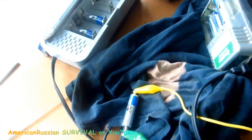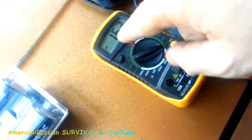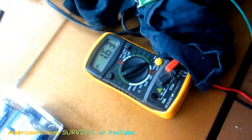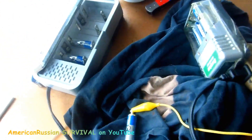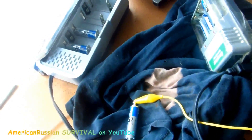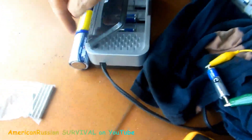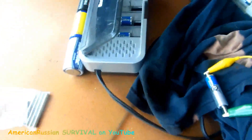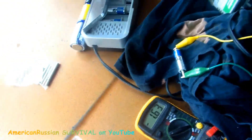What you need to do while charging is check your voltage, charge for a while, then let it sit and cool down for about half an hour, then charge again. More than likely you're going to bring that battery back — not 100%, but probably 80 to 90% of what a brand-new one was. The key is not damaging it with too much heat or too fast a charge. They're not designed to be recharged, but I've been very successful with Rayovacs. This is for last-ditch emergency maneuvers, not for saving a couple pennies.